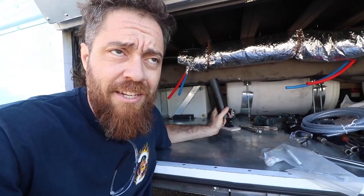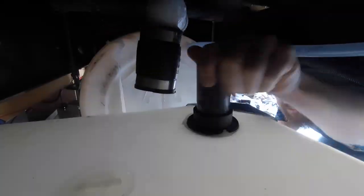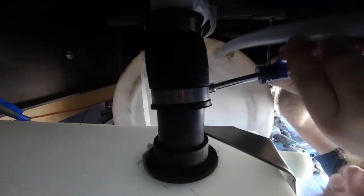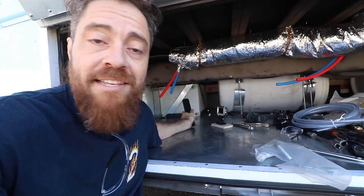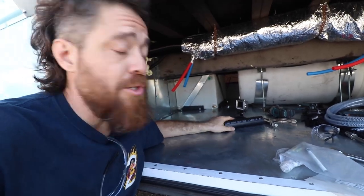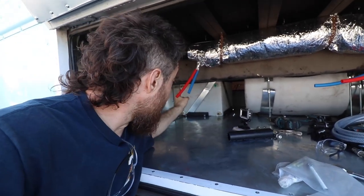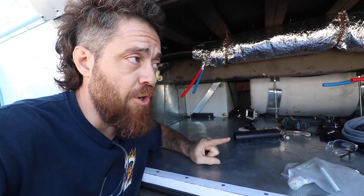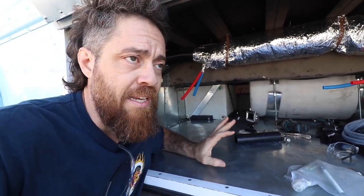So next up, to connect between the Fernco that is attached to the Hepvo and the grommet that is the entrance into the tank where the drain of the shower is gonna drain into this tank. And so we've got a plug in the original fill port because we're not gonna use that fill port. This top left one here, we're gonna use as our fill because we're gonna have it plumbed into our main system just for filling up.